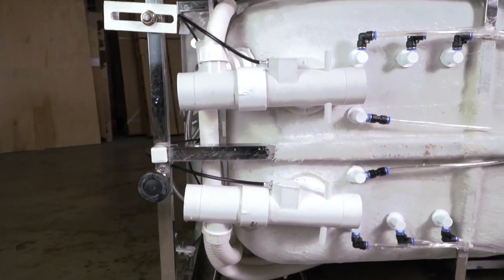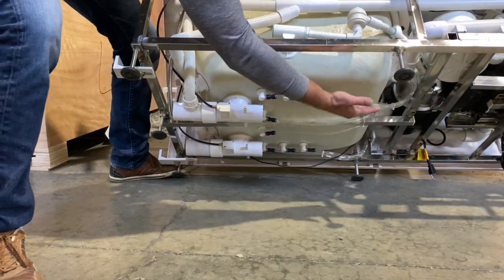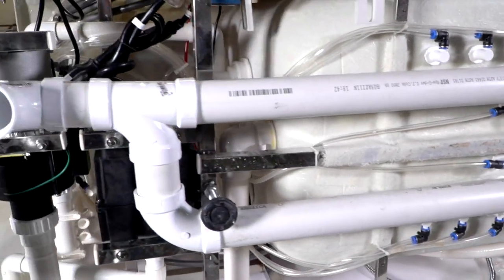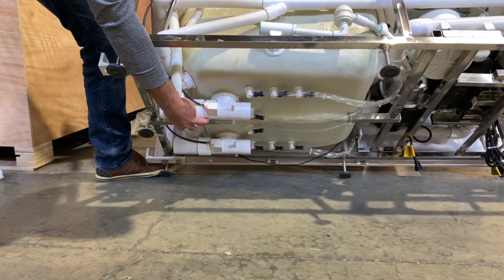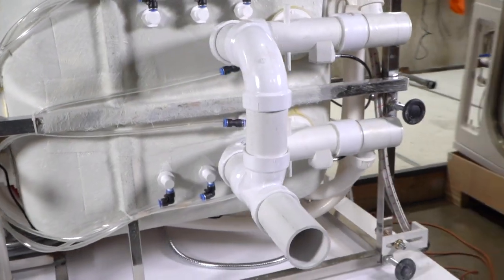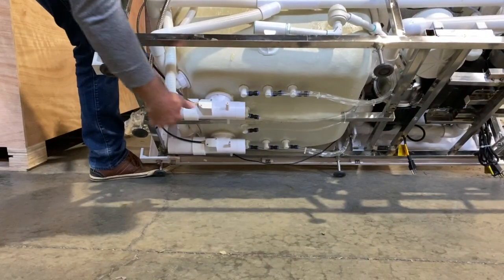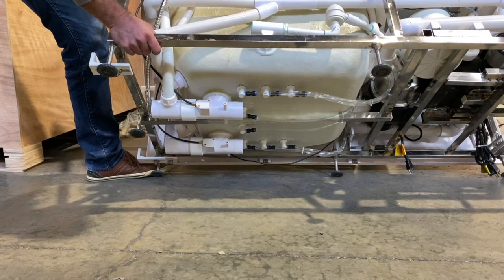What this does for us is from the installation perspective, it allows us to get the most direct shot to the drain, whether we have to reverse the plumbing, if we're keeping the plumbing on the same side. This bathtub gives us the most versatility and options as far as actually running our plumbing and making it as efficient as possible so we can get as straight as possible right to the trap and right to the waste on the house.